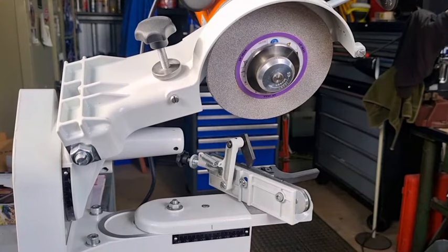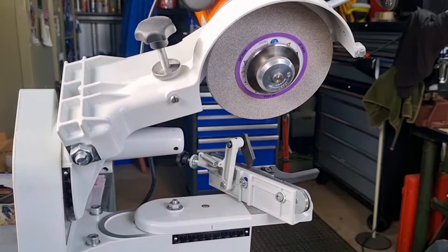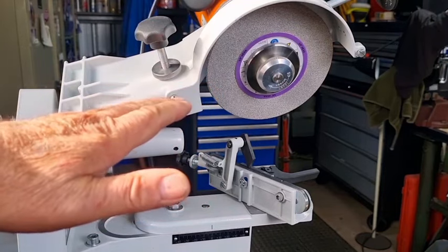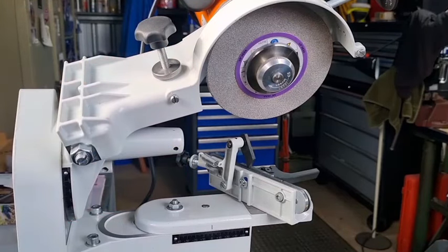A side plate angle of 60 degrees, considering that the down angle on the Hexa is a straight line — there's an error somewhere. All I'm trying to do is find out whether this Hexa wheel matches a 30 degree profile or a 25 degree profile, so we'll do the next test and see what happens.